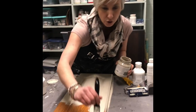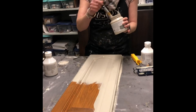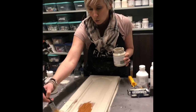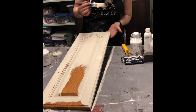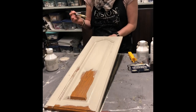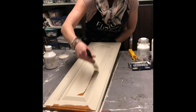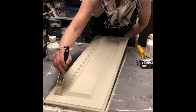When you are done painting your first coat, you can go back and do your second coat. When you're doing a kitchen, you've got multiple doors to do. I really like finding a space where I can put all the doors out and set them up on either soup cans or blocks of wood — something where they're raised — so that the edge isn't going to stick to the table as it dries. You'll also want to decide if you're going to paint the inside of the doors, then let it dry, flip, paint, dry, flip, paint — doing that two times. Kitchens are a lot of work, but they are so worth it.